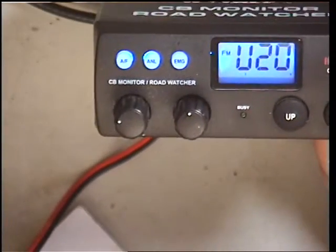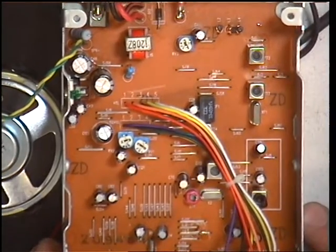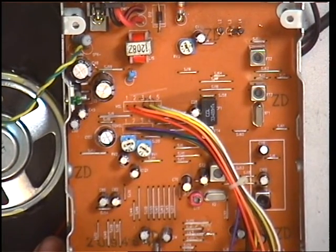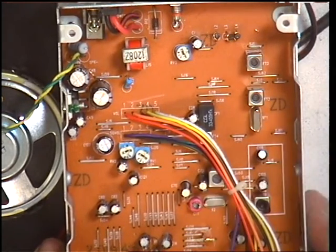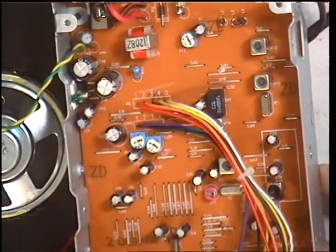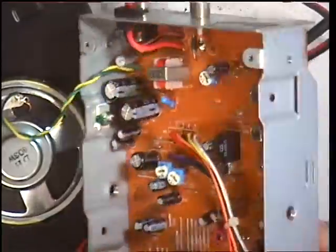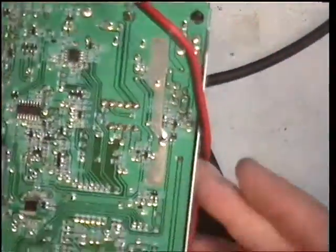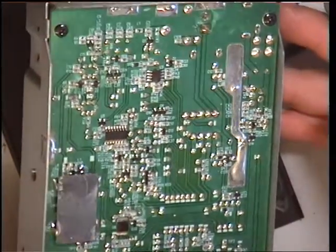Right, I'll open it up. So inside we find an SRBP board. You'll probably realise that a lot of CB radios today have moved away from SRBP - which is synthetic resin bonded paper - and onto fibreglass printed circuits. So there's the usual kind of coils. It's not a CB radio which is half populated as I guessed it would be - I was totally wrong. It's dedicated for this job, and it's all surface mount, synthesised, clever chips and all that, just like you'd expect in a modern CB radio.